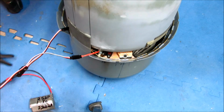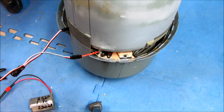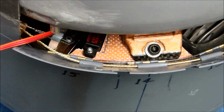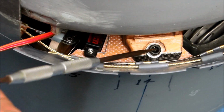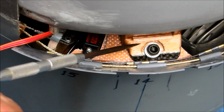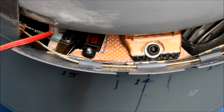Okay, and here finally I've got the fuselage sitting on, well actually it's sitting on the engine's output shaft and the cowl. And so that we can take a look with proper lighting and be able to see the way some of this stuff works. So you can see the cowl mount screw here. It's a 1032 going through this block, which is 1/4 inch aircraft ply, and 1/8 inch carbon plate, and it's backed up with hardwood triangle stock, and everything is wrapped in 12-ounce cloth, and there's also a layer of 9-ounce carbon 90/90 cloth on the backside.